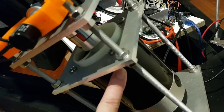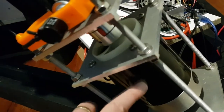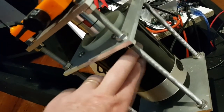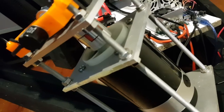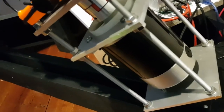If you choose something with a very high current, so more than 32 amps, you'd have to go to a Sabertooth 2x60, so an added expense, but the main thing is you're going to have to add these batteries, take up space and more cost and so forth. So choosing the motor is absolutely critical.